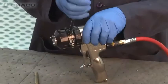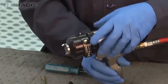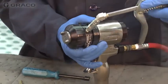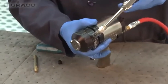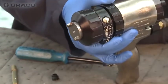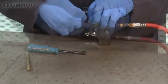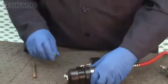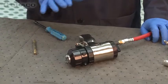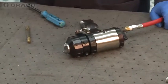What we want to do is open the grease zerk cap and give it one or two squirts of the iso grease. We just want it to mist out of there — we don't want to pack that mix chamber with grease. Two shots, turn off air, return the cap, safety's on. That's a quick way to clean your mix chamber out, whether you're in your trailer or you're still anticipating spraying.